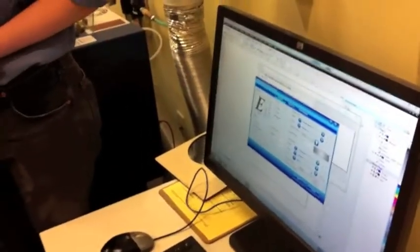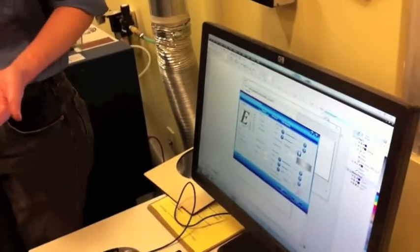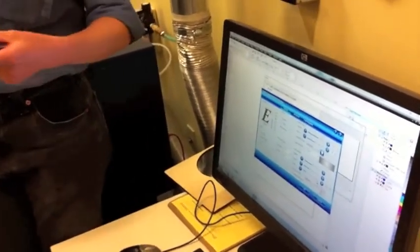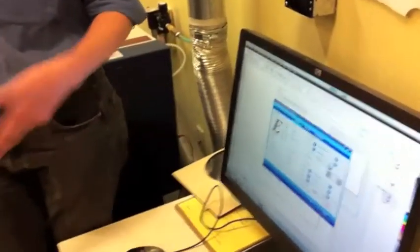Usually, once you get a little bit of running it at 500 hertz, you get a perforated line. So that's how you can use frequency to cheat and get perforated lines. Just drop it down lower and lower, and then you're just having very intermittent pulses. Acrylic is going to give you a nice smooth walled cut at about 5.